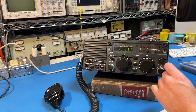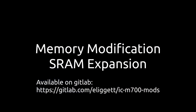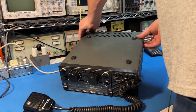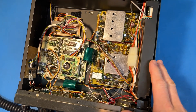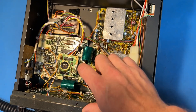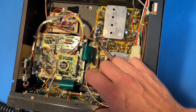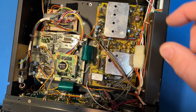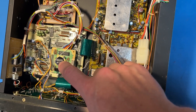Let me go into exactly how I did the memory modification — I have to flip the radio upside down to see it. This is the OEM RAM board right here; it has an SRAM chip and I think an OR gate over here. The SRAM chip is what we're interested in. Its battery, by the way, has held charge since 1984 — amazing — still more than two volts coming out.